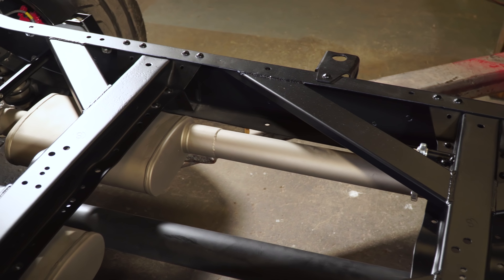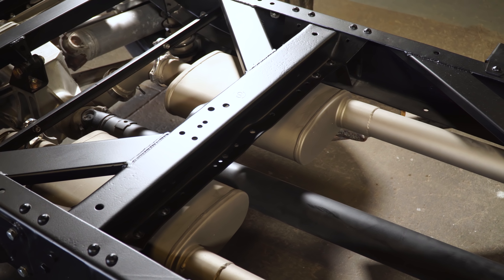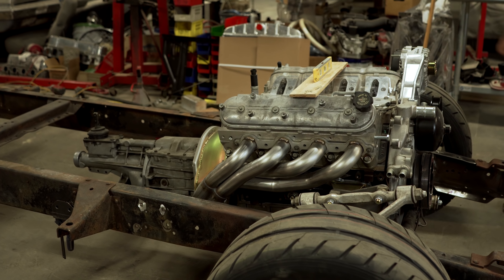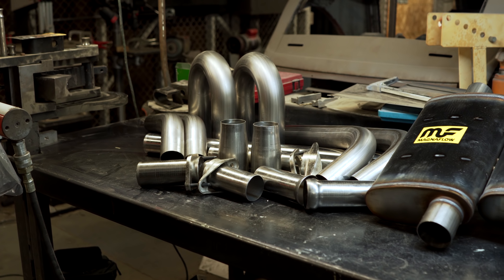In this particular case we opted for the two-and-a-half inch dual exhaust. We've done all the dyno work in-house and found we can support anywhere between 425 and 475 horsepower depending on the type of aspiration. Big cam cars have very different exhaust needs, but in many cases a dual two-and-a-half has been seen to support in excess of 500 horsepower with zero loss.